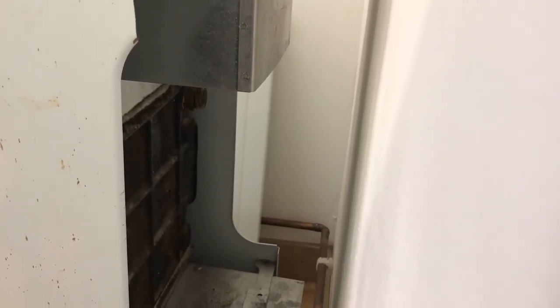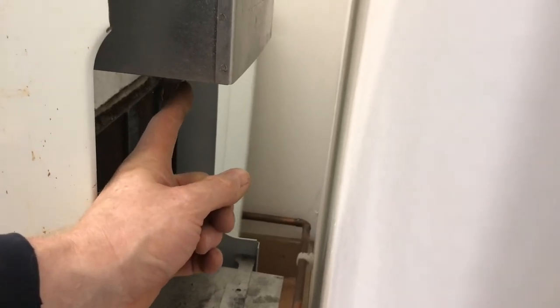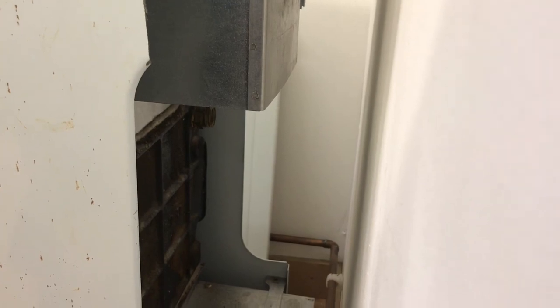We would then do a spillage test with the appliance running, and again we would use our smoke holder, again 25mm down, 25mm in, and we would do the spillage test. So that would be the spillage test on an open flue floor standing boiler to the manufacturer's instructions.